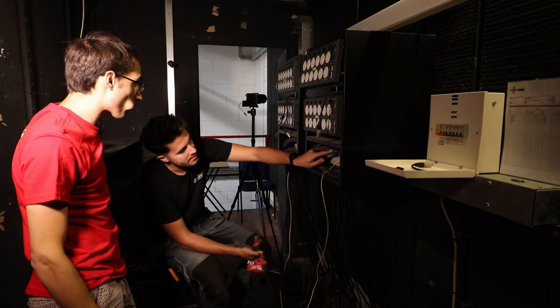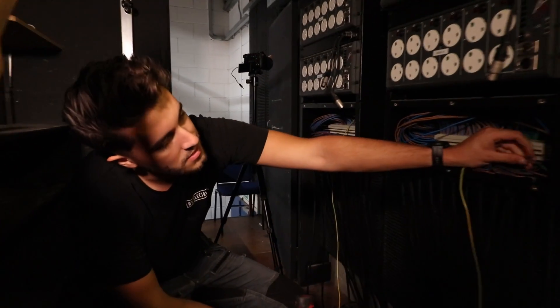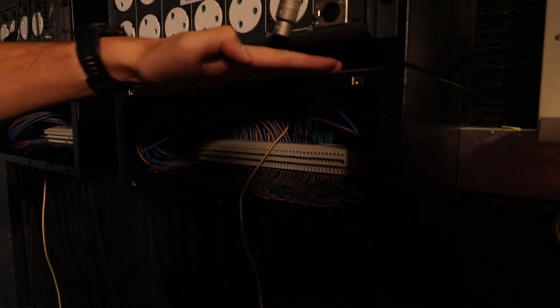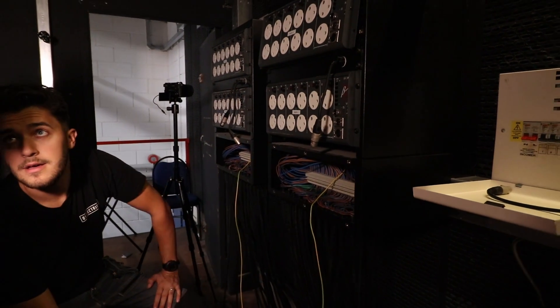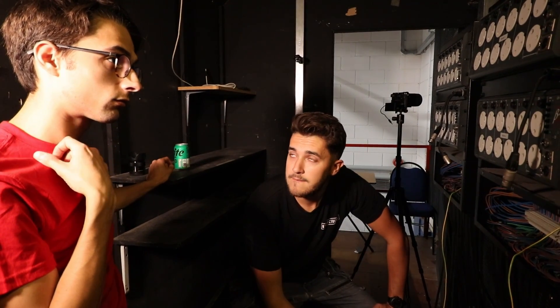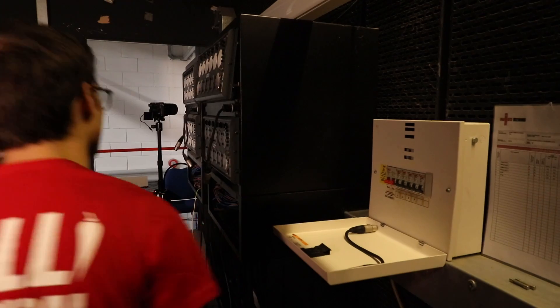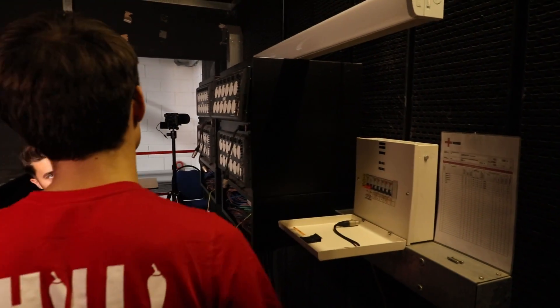I'm going to label up these cables with the correct ident. You've got these idents on the cable but they're not the right ones. So I'm thinking if we kept that connector block, you could even put a blank panel on the top, take the top half of the rack off and mount the DB just on top of the rack — just keep this bottom section. You can even keep that section for your multiplex. So we could take that off and just replace the board here because that's going to have cable entries, and then it's even easier. Keep the cables routed through.